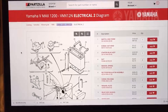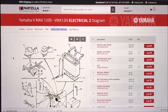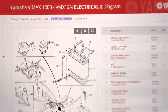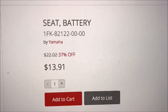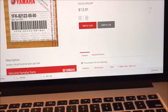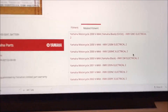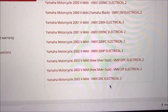Looking at that battery box, I noticed there's no rubber pad underneath. Well-designed motorcycle and powersports battery systems almost always have some type of rubber dampener or pad under the battery. Looking here on the parts diagram, item number 12 — they're calling that the 'battery seat.' You can also see what it fits, and they've used that rubber pad on these V-Maxes all the way up to 2003.